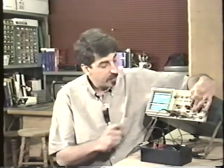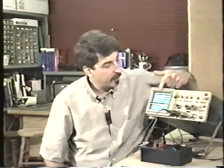And here's what we can do. The seconds per division control is for A and B. If I pull this knob out and turn it, I'm speeding up the B sweep. And you can see the B sweep here on the bottom is moving faster than the A sweep. Not only can I select a faster sweep speed, but on the top I can see what part of the waveform I'm illuminating. Look, the B sweep is a little bit brighter. Watch as I increase the B sweep speed.